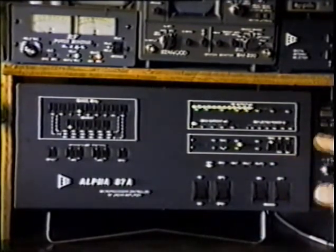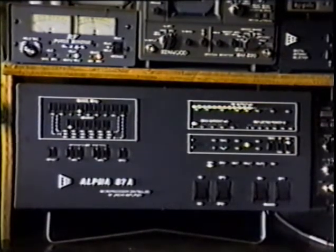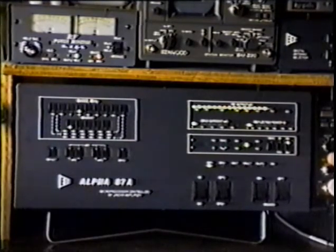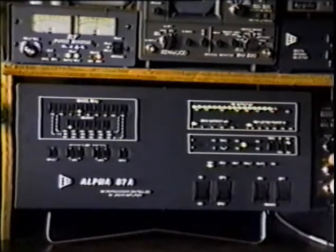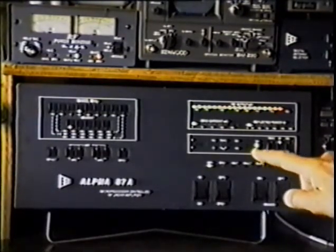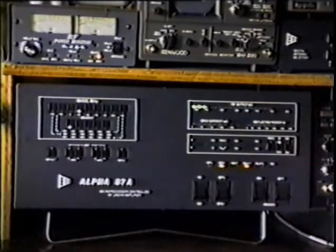Now let's say I had the plate meter in the high voltage position — it's reading plate voltage, maybe 2,400 volts right now. And I increased the drive. Now the plate current is apparently less than 1.4 amps because nothing has happened. But as I reach some point here, you see this just switched to plate current. This is an amp and a half, and after 3 or 4 seconds it has switched to standby.